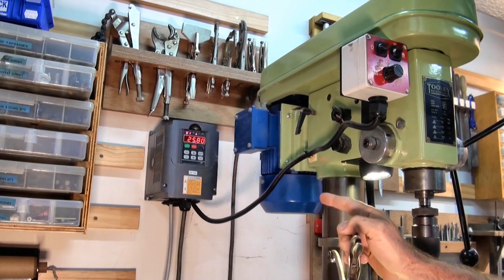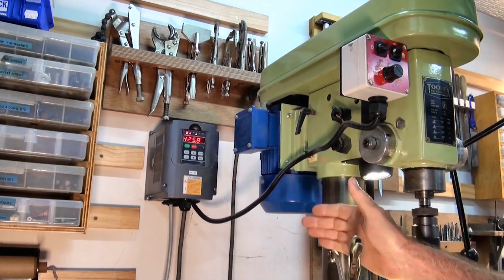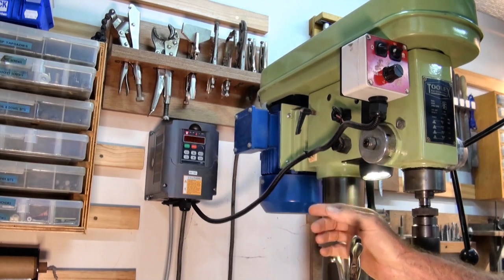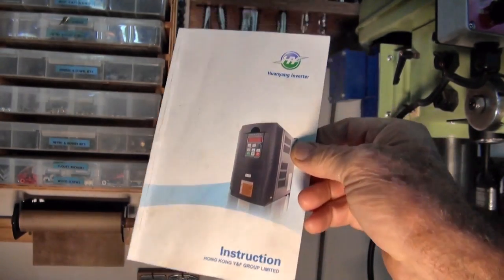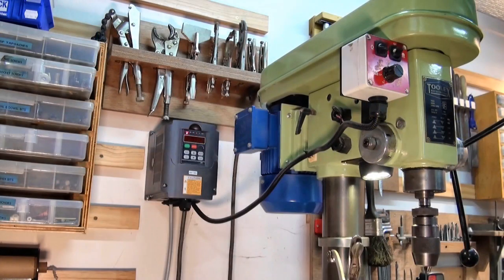What I'm looking to do is find a way of temporarily disabling the fan so that it only cuts in when it's needed — on a really hot day if you're using the machine hard and the heat sink is likely to get hot. I read through the manual looking for a software function to turn the fan off. Couldn't find anything. I posted a question on a forum and a lot of users got back saying they didn't know any way of disabling the fan through software settings either. A lot of people suggested fitting some sort of switch or sensor to override the fan when it's just idling.